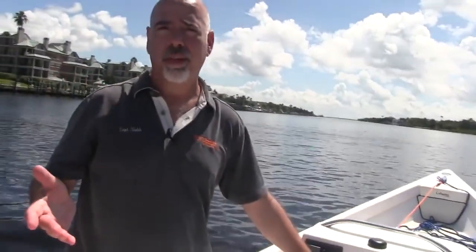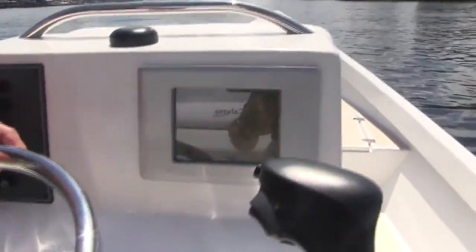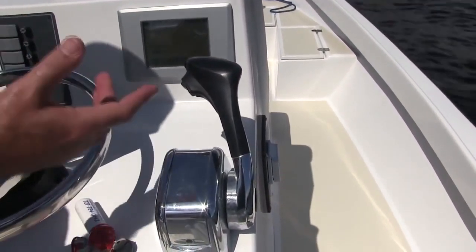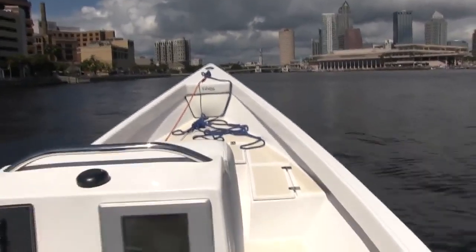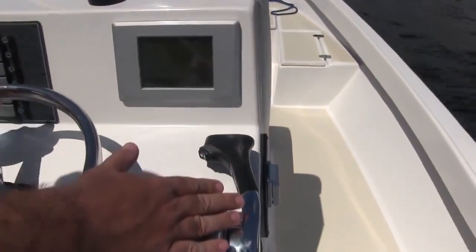You can tell the motor is quite powerful. Electric motors develop power a little bit differently than any internal combustion motor — the torque is available from one RPM, and I can control the RPM down very low, much lower than an internal combustion could ever go. That allows you to maneuver with ease, especially with a heavy workboat or a large ecotour platform. The motor also has a boost mode: when you go full throttle, it pulls more than the rated power for a few seconds, then throttles back as it achieves plane. It jumps on plane very quickly, then throttles back to a constant rate — in this case, 28 kilowatts.